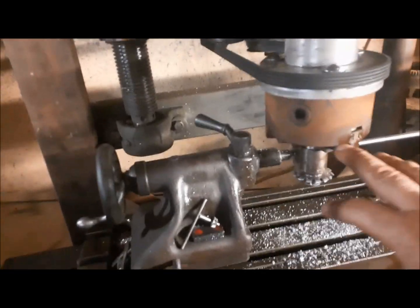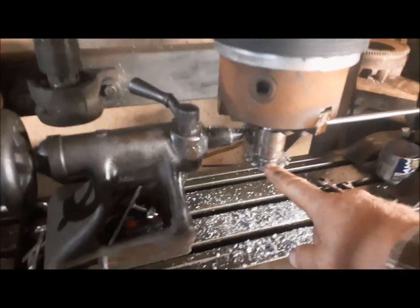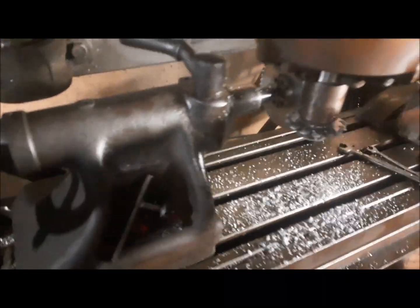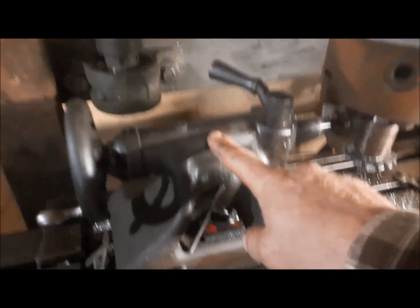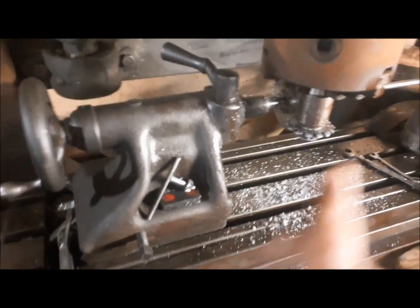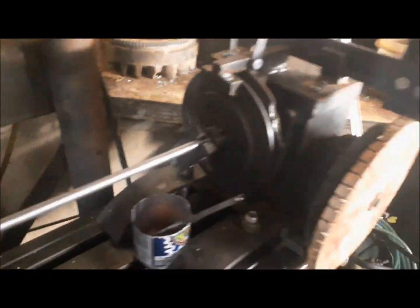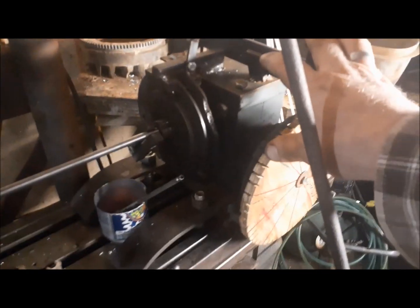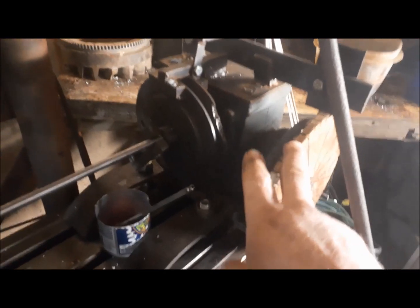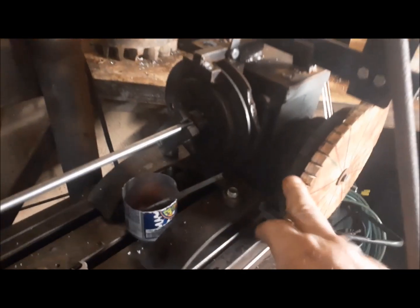So, on my mill, I have my 52 tooth cutter. It's in the 3-jaw chuck. It's on a mandrel. One end of my camshaft is on my tailstock. There's a little divot there, and I put the dead center into it. And at the other end, it goes into what is called my indexer. This indexer is a 20-to-1 ratio worm drive. It's a right angle worm drive.